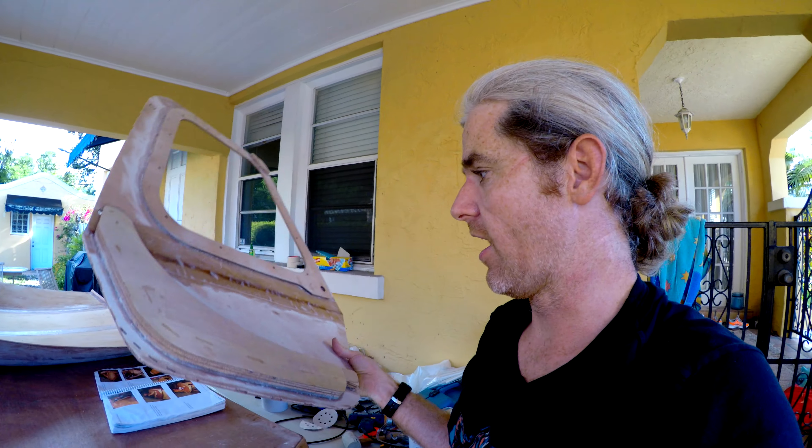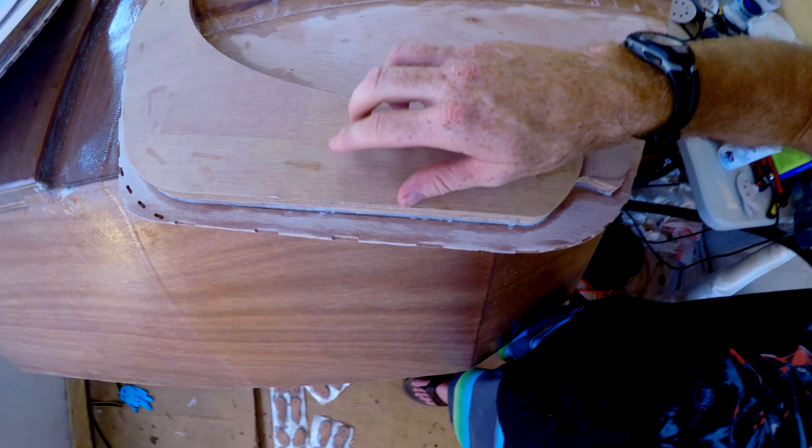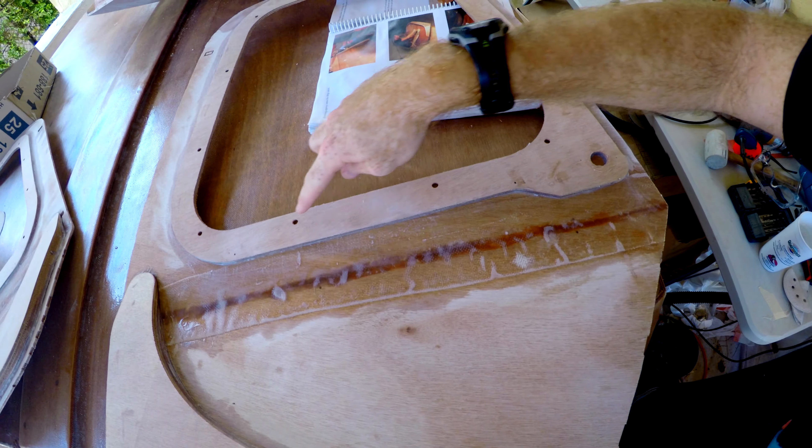This is a door. The doors are cut out of the main shell and it's actually pretty thin plywood. Even with the glass it's a little bit flexible, so to make the doors stiffer you have to add these elements here. This is called a door stiffener, and then this is a little stiffener that goes in with a window. It's sort of a complicated part because you've got to be careful not to change the shape of the door, otherwise it won't fit back into the shell — and apparently that's an issue a bunch of people have had in the past.